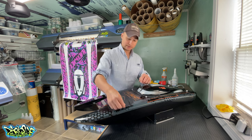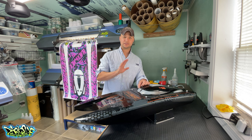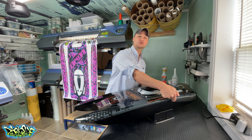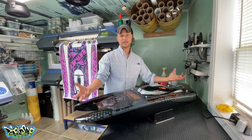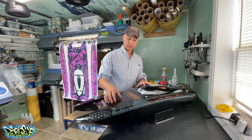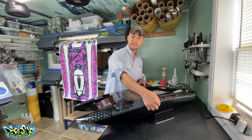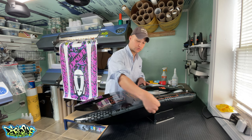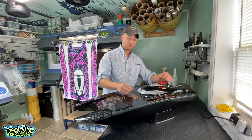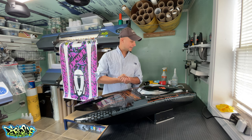And what I found is this seam right here is a different thickness across the spectrum of Blackjack 42s. The reason I think is because when they vacuum form it, somebody is coming through here and trimming this. Then they put them together and they're glued into one piece. With that said, this boat in particular, this strip is going to be installed and it's overcut intentionally so that you can trim it to fit just this little strip right here. I did this to try to tighten the gaps here for people and have an absolute professional look when it's done. So we'll go through that.